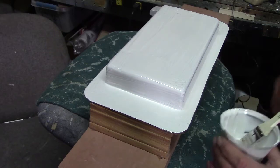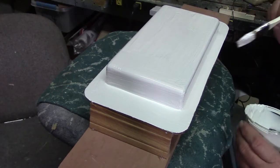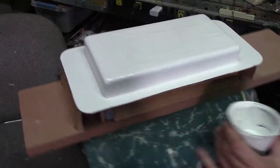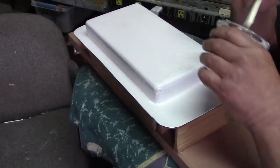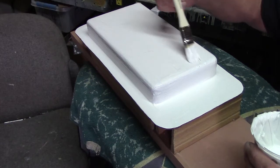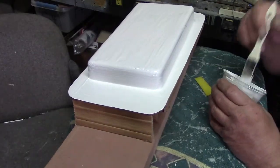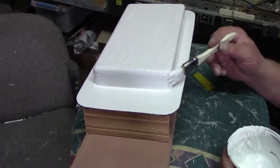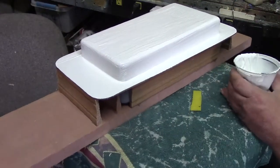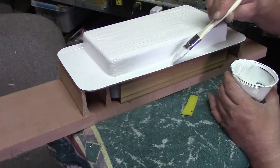Doing the shoe box thing like I do my molds now, you don't have to worry about them warping so much. It's when you do the flat molds and you don't put the shoe box on there and you just do a flange — well that will keep your flanges from warping. This is just going to be a flange mold, it ain't going to have the sides. It doesn't need to be that thick for just a small fuel tank mold, but on your bigger molds your numbers should add up to a hundred, and that makes about the perfect thickness.